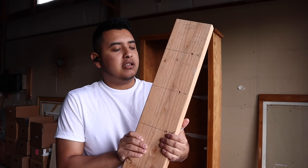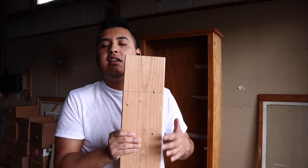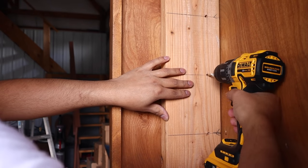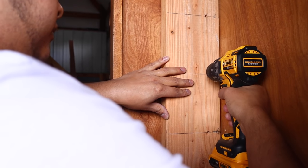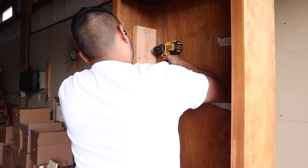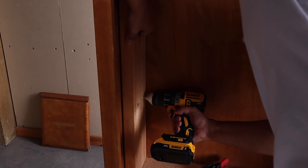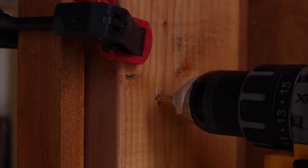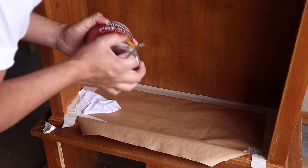Now I'm going to go ahead and make some holes for the adjustable shelves on the cabinet. I took this scrap piece of lumber to use as a jig, and I basically made some holes here that are evenly spaced out — this will ensure that the shelves lay out evenly and are not all wonky. When you have adjustable shelves, there's a whole bunch of little holes where you can adjust the pins of the shelves. I'm going to create those holes with this jig that I created with pre-drilled holes and the spacing already planned out. You don't want to go through the cabinet because that would be awful. There are also great YouTube videos out there that explain this in more detail.